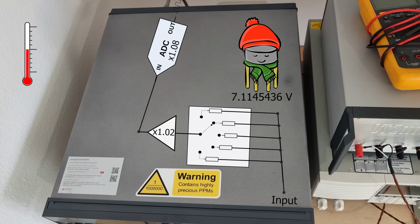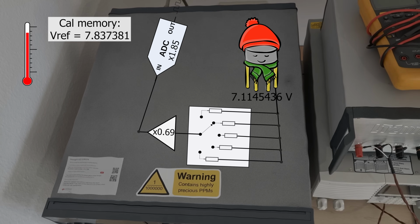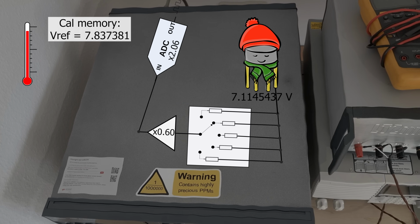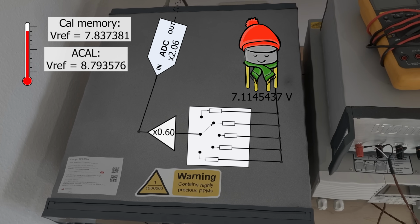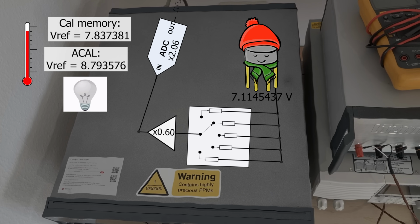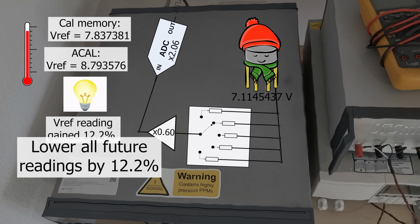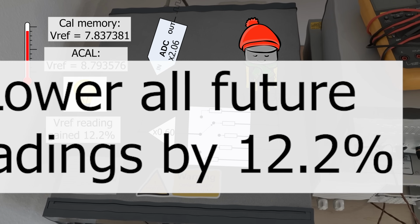Instead, during an external cal against a known voltage standard, the meter also measures its own VREF through its own ADC and front end, and memorizes the value. Then, at any point in space and time and temperature, it can do that again, to find out almost exactly how far its own components have drifted since the last external cal. It uses a similar principle for resistances, and afterwards it's trivial to correct the measurement results mathematically if necessary, to compensate for the drift of nearly all internal components.